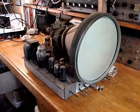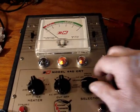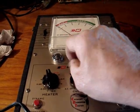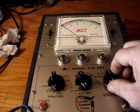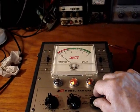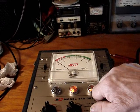The next step is to test the CRT. I've let this tube cook for a while and there are no shorts — I've got the right indications on the lamps. Emissions? We're right on the border. So the tube is not that good. It's got cutoff but not very good emission, and it's even going down a little bit. Maybe this tube isn't really worth it. It seemed to me that it did have a picture on it, but the tube just doesn't seem that good.